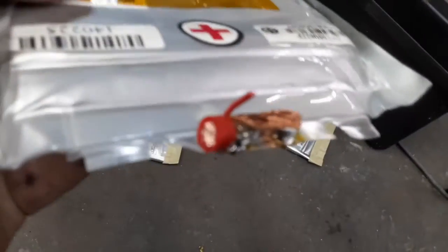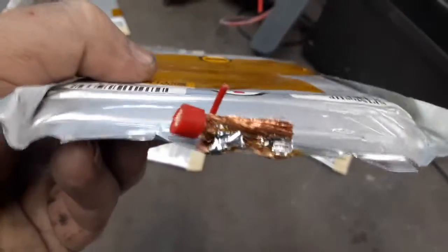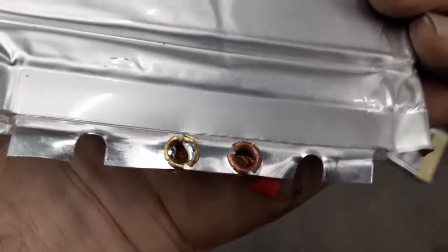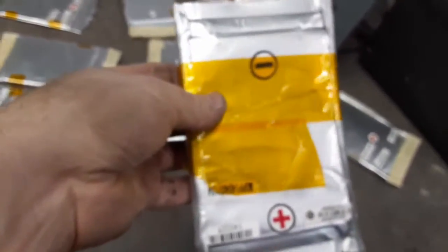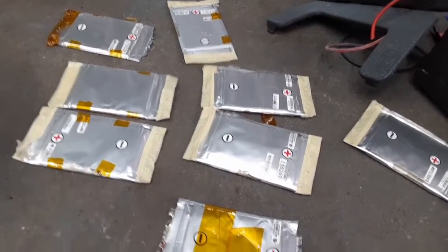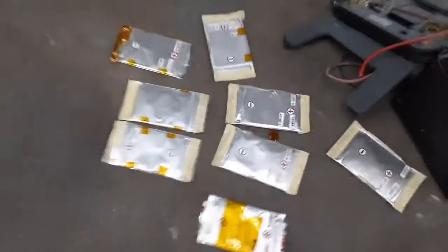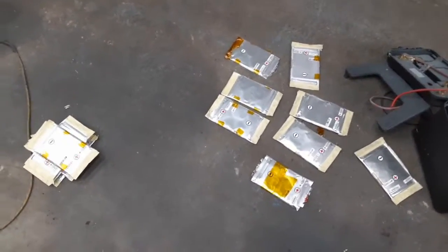I'm going to charge the good ones up and see if they hold their voltage before reusing them. This was the end pack — riveted and soldered — and there's no corrosion at all. This one had one brass and one copper rivet and there's no corrosion on either, so that's not a concern. That end pack tested at zero volts, so it's definitely bad. All the bloated ones I'm not going to bother testing — they're done. I thought it would be interesting to show this since there are a lot of build videos using these packs, but I don't think I've seen any failure or disassembly videos — so there you go.